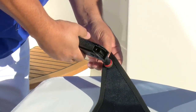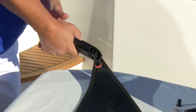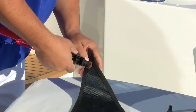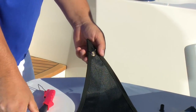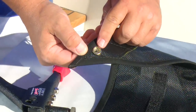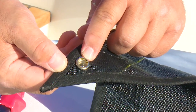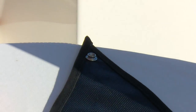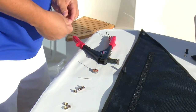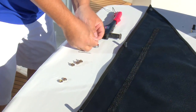Squeeze the trigger — you'll feel it grab the mandrel — and then just squeeze until you get good pressure. You don't have to go crazy with these things. Back the tool out, pull the tool off, slide the mandrel out, and inspect the curl of the barrel rivet. And that looks awesome. You can use this mandrel probably twice for Gypsy Studs before you should replace it.